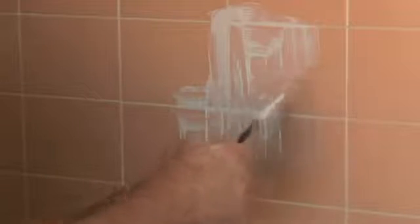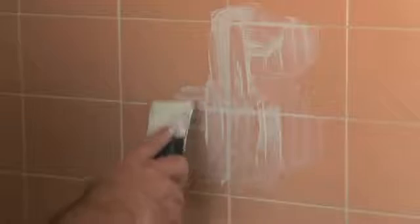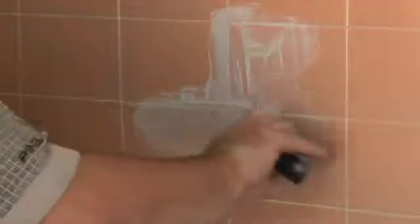One thing you will find is that even though 10 years ago this was snowflake white grout, and you get a box of snow white grout, it will look a little different until it dries. It just takes a little bit of time to get that fading in there to match the other stuff. Once you do that, take your wet sponge, clean water, and just wipe it down.